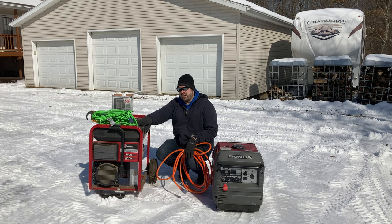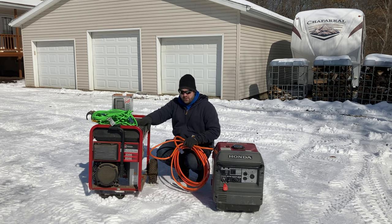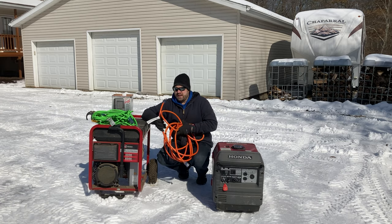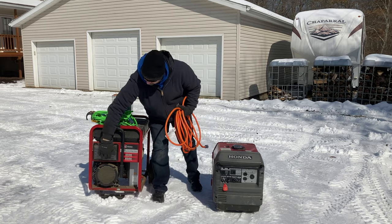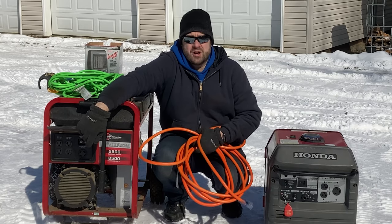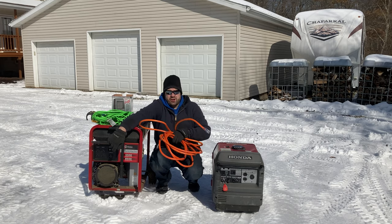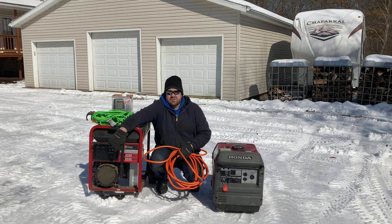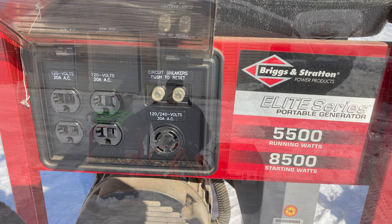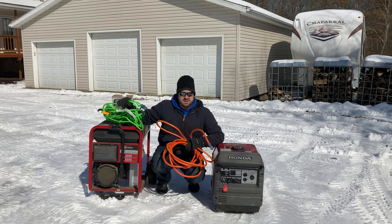This generator I've also had for over 10 years. It usually stays in the garage and is for powering things in the house. Before I even had the GenerLink, I used this in an emergency power outage. I'd connect a really heavy-duty 10-gauge extension cord to the plugs on the front of the generator — there are four 110-volt plugs available — then get the line into the house and use extension cords inside to power the refrigerator, pellet stove, and freezer.